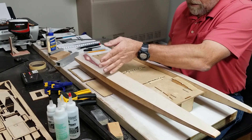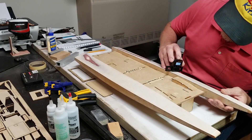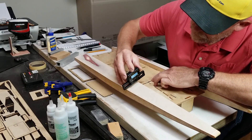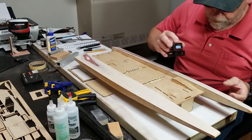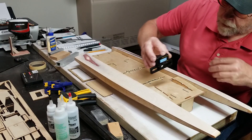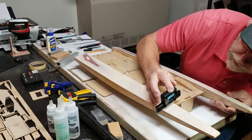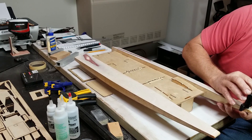Checking again: 17 degrees to the end of the ride pad area on one side; on this side I'm getting 16 and a half, 16.4, 16.5 — nice and flat. 16.5 here, 16 in here, 14 and a half at the transition, and getting around 8 to 8 and a half degrees on these tips.